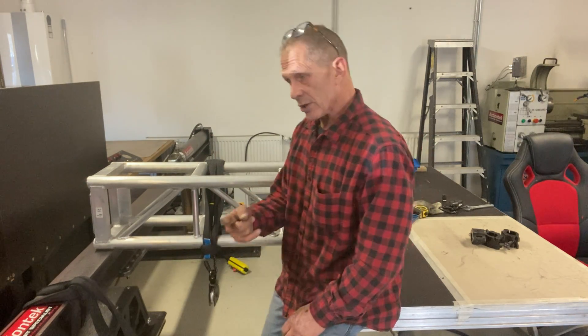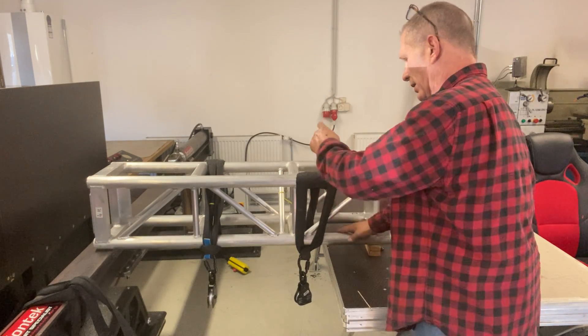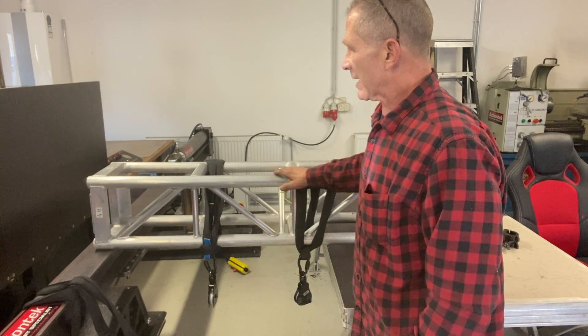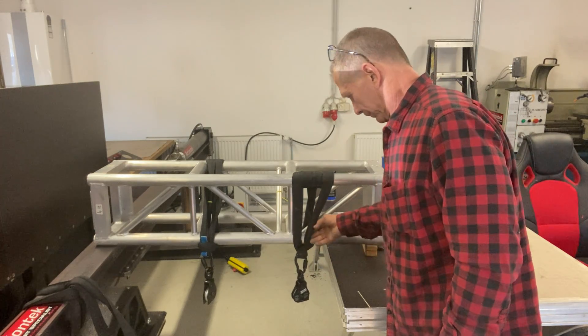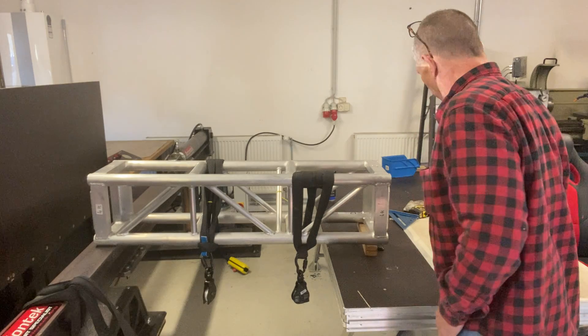Here the load is this way. You don't see the cross here, it's on the other side — that means the load is going the other way. Just a few things to think about. Keep these short. Keep them choked tight. You can always catch at least two beams. It's always a better way to do things.